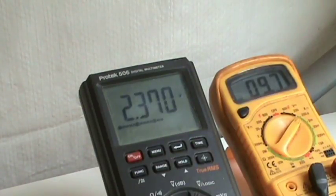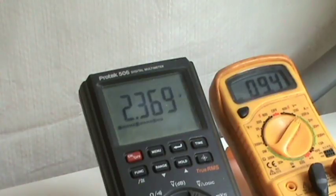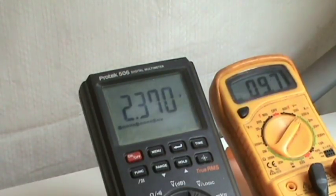The reason I added that coil is because I've done this in the past, but without the Cockcroft-Walton multiplier and without the oscillating circuit. So we just had the one small circuit on there. And I'm almost positive with just the one circuit, I can get up to 40 volts. But I don't know if I ever checked the current at that time. It's kind of making me think maybe I should go backwards here and tear everything apart. Start from scratch. Well, anyhow, let me keep thinking.